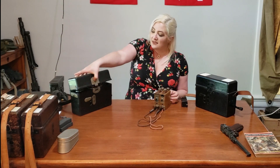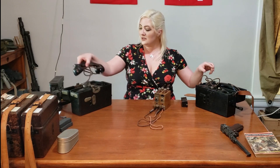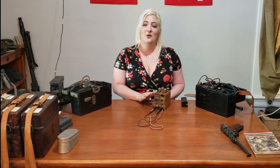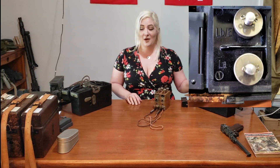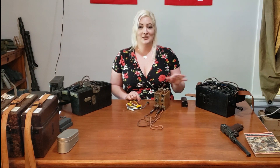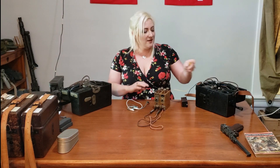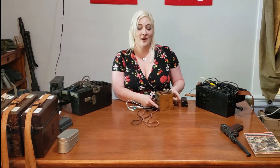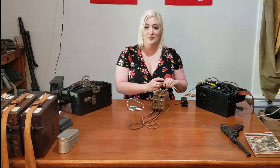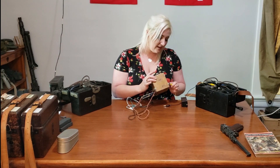In past videos we've discussed how phones can be connected to each other either through the patch cables in the front of the phone or the terminals at the very top of the phones. For this to work, these need to be connected through the terminals at the top of the phone. Because it's just me, I'm going to make this very simple — we're going to have this phone act as the operator and this phone act as the line in. The first thing I need to do is get the operator phone connected to our little switchboard. The operator line is always going to be connected to the terminals on the front and the back, same as with any other German piece of comms equipment. It doesn't matter if the yellow cable is connected to the front or the back — it would have the same effect.